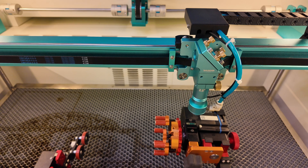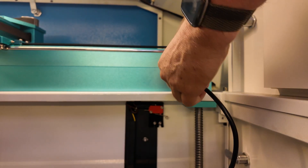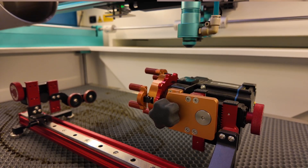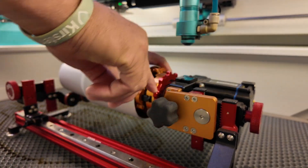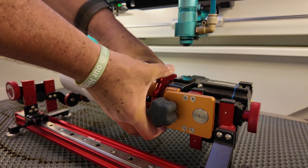It's a pretty cool feature — I just found it this week. That being said, let's plug in our unit and load up the tumbler. Your Nova Plus already has a pre-wired 7-pin connector, so you can just plug in your rotary and jump into LightBurn. You'll hear that click — that's the machine recognizing that you've just connected a new device. You're doing basically the same thing you do on your Bolt, just now on the Nova Plus. I'm a big fan of these HexaJaws — you get a nice, firm grip every time.